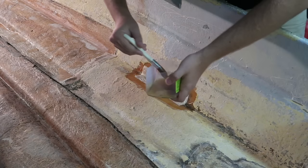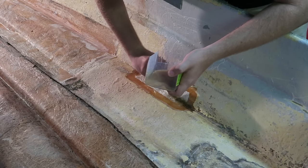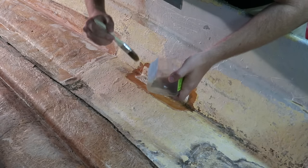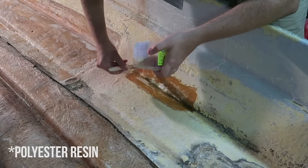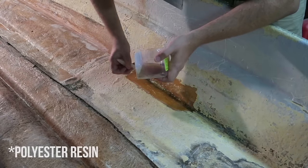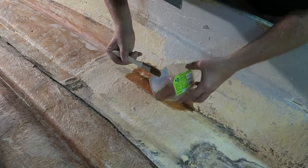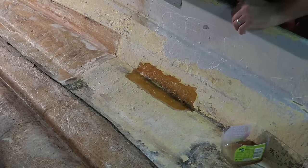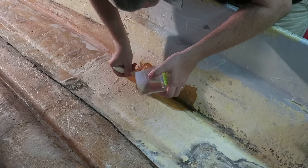In this situation — and by no means am I an expert — I knew I wanted to build up the hole because the original piece of chop strand was falling through or pushing through the hole. I wanted a quite thick layer, so I'm just going to keep laying piece after piece for basically as long as the epoxy hasn't set. You've got a bit of a ticking time bomb working with epoxy — only around 10, 15, maybe 20 minutes of work time. So I'm getting as much down as I can while the resin is ready to go, and I'm patting down any air bubbles I can see.